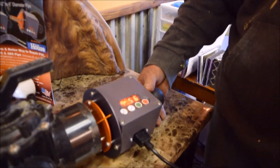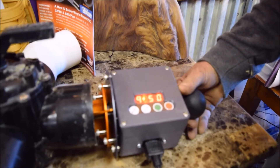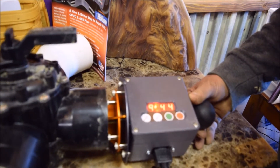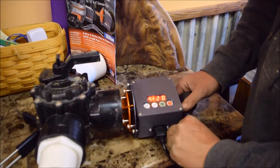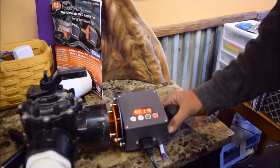What that's going to do is heat the inside of that pipe for a selected amount of time based on the size. In this particular case, thicker pipe obviously takes longer — it's counting down nine minutes and 45 seconds at this point. So 10 minutes is enough for the unit to melt and soften the pipe on the inside enough that I can use a tool to extract it. We're going to leave this for the right amount of time and then see if it does what it's supposed to do — nine minutes and 20 seconds from now we'll pull the fitting out.